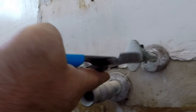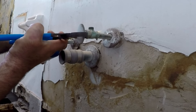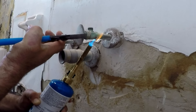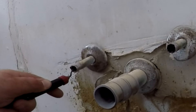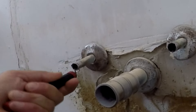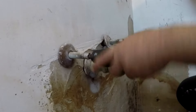Now some people will just put the new fitting on the pipe while the old solder is still hot and add more solder to it. But we are going to clean the old solder by sanding it down until we get down to the copper, and then put on the new fitting. Use the reamer to clean the burr inside the edge of the pipes, and use the half-inch round brush to clean the inside of the pipe.